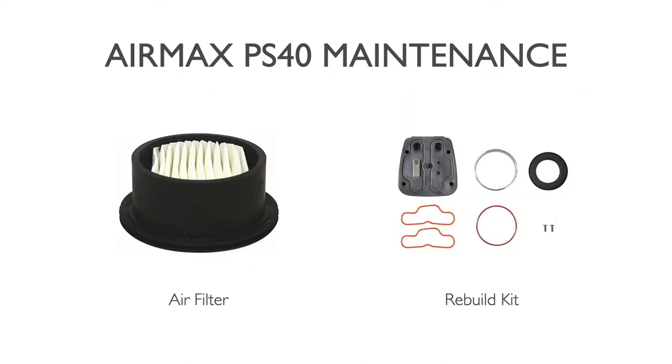In terms of maintenance — and this applies to all rocking piston systems — there are two points to focus on. The first is the air filter cartridge. The cabinet's pre-filter keeps the inside fairly clean, but some small dust and sediment can reach the internal filter. Check it every few months to get a feel for how often it gets dirty. Many people get six months to a year per cartridge, but change it whenever you see buildup to maintain good air intake into the pump, which helps with output.